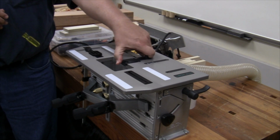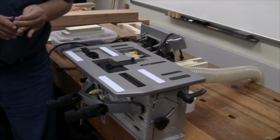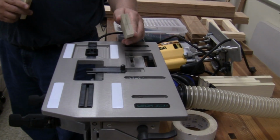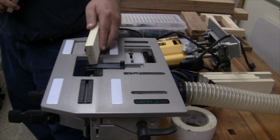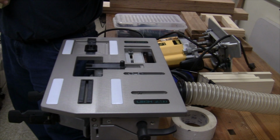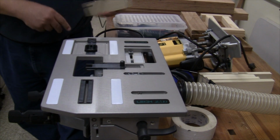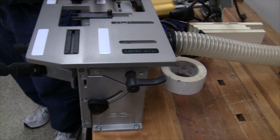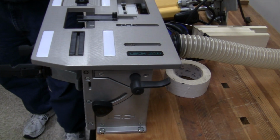There's a little aiming window here in the middle, which is how you sight in for your mortises and tenons. Put a crosshair on your work pieces, and then you sight it into a little window in here. And again, once it's sighted in for the tenons, on the mortise all you've got to worry about is left and right. A lever on the right side unlocks, and then the table moves front to back, left to right, in order to sight it in.